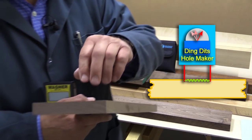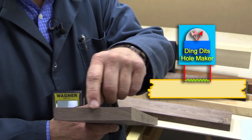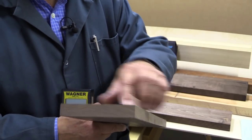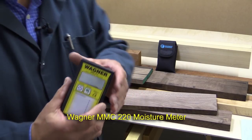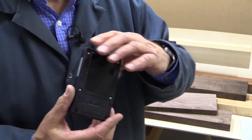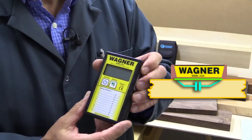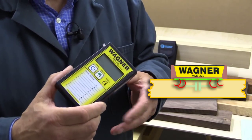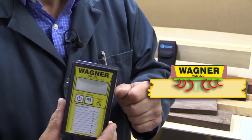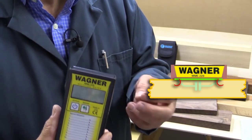The pin method also has the problem that no matter how hard you try, when you stick those prongs in they're not going to go very far, so it's measuring resistance close to the surface. There's another type of meter — the one Wagner sent me — and it's got no contacts at all. It uses a capacitance measurement process, sending an electric field into the wood. It goes in quite a reasonable way, so it doesn't damage the wood and it's not going to give you a shallow reading — it gives you a truer reading.